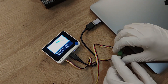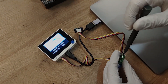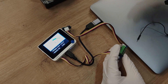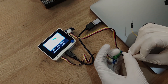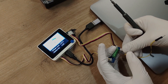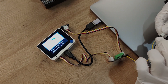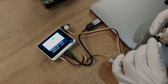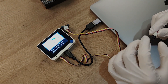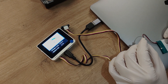We can also read differential input to measure the voltage of a battery. For differential input, connect the jumper. Now let's try the LiPo. Here you don't have to mind whether you are connecting the positive or negative, left or right, because you can read positive or negative values.